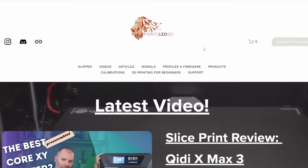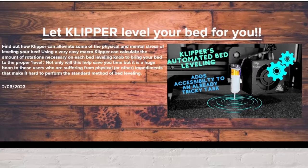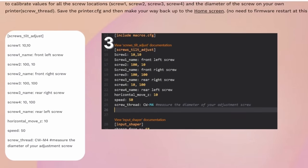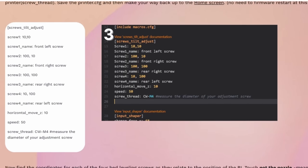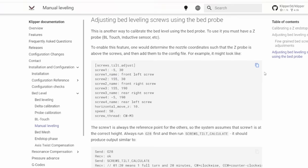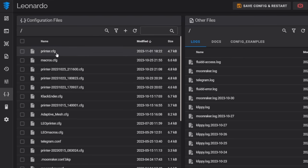Now for that, you can look in the description of this video. You can go to my website or you can even go to the Klipper documentation. As you can see, it is a very simple set of text commands. It's the location of the screws that we just got, as well as some speed and some thread requirements. I'm going to go on the official Klipper website, copy that from there, then move back to my front end. From here, I'm going to go into my configuration file, and then I'm going to go into my printer.cfg. That's where I need to add this.